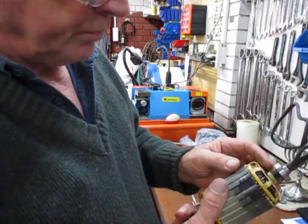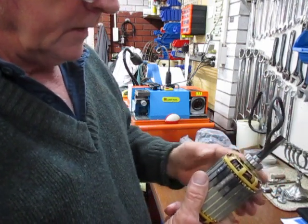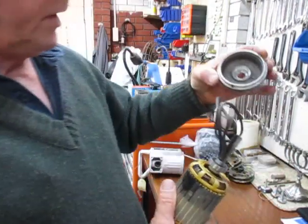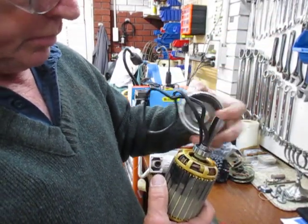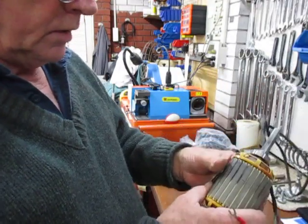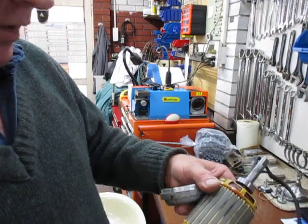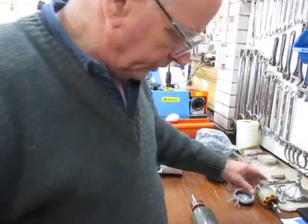I've mounted that bush in. We're probably going to put some bearing mount in the flogged out area there to sit it in. And at the same time, the bearing shell — I've machined that out to suit the imperial bearing. So we managed to fix this one fairly easily, and that's going to be picked up for delivery soon.